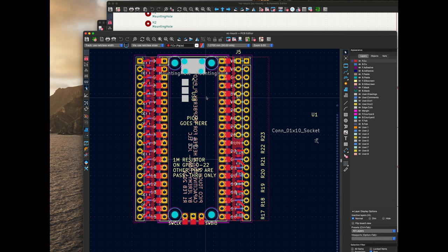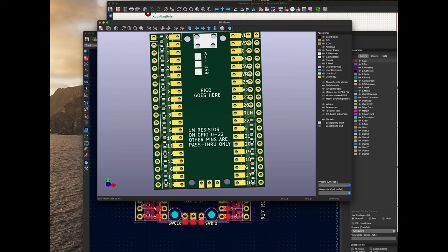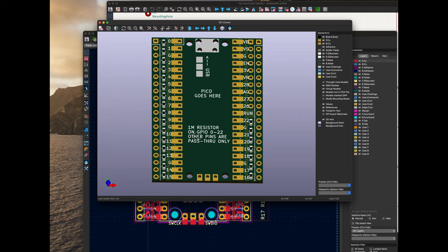Looking at the actual PCB layout, I made the right side just a tiny bit wider. This allowed me to fit in the seven 1 mega ohm resistors and also allowed room for the duplicate pins. This also let me put some labels in there, which could certainly be useful in many situations. Looks pretty good. There's no rat bite section, so this can't be split into two, at least not easily, but I found that would probably be of limited use.